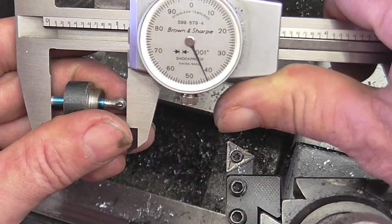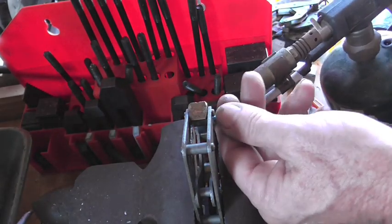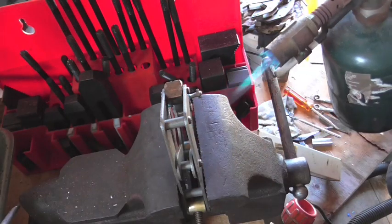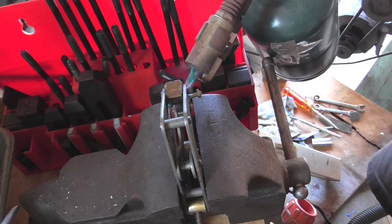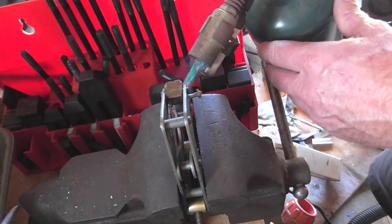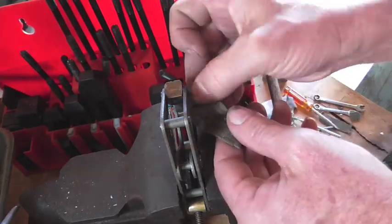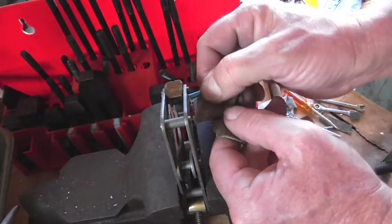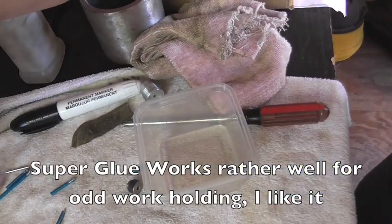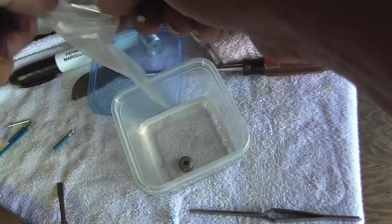One inch 143 — I'll take that. I've got it clamped up, going to hit it with some propane to break the bond, pull it out, drop it in some acetone, and move on to the next one. I'm not going to show all three — no need. This is acetone to get rid of that glue residue. I'll do the other three off camera.